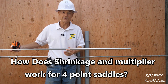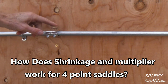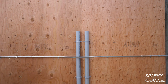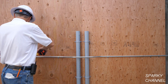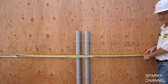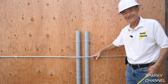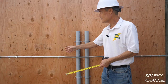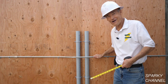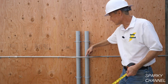Now, this is a 72 inch piece of conduit right here. It started right here — this screw is actually the mark where the conduit starts. If you take your tape and put it on the screw here and measure over to where the conduit ends, it's 70 and a half inches. So this conduit lost an inch and a half, and we call that shrinkage. The shrinkage is a pretty easy concept: if you make these bends, this pipe isn't going to be as long as it was when you started. In this case, it's an inch and a half shorter because of these four bends.